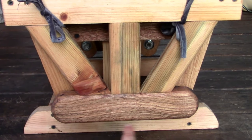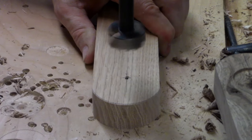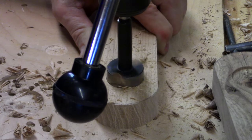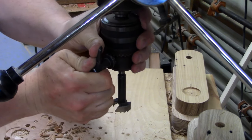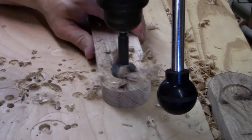For your outer bottom swing, this portion right here, you're going to have to drill 3 ledges for your bearing to rest on. These need to be extremely precise as to the fitting of your bearing. So make sure you have the right size Forstner bit for each ledge of your bearing. Two other things to keep in mind is that, 1, you need to keep both holes an equal distance away from each other, and 2, you don't want to come through to the other side with your deepest hole, because otherwise your bearing won't fit tight enough to support any real weight in the long run.